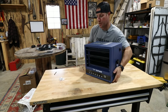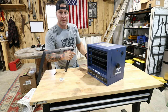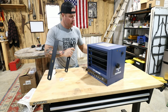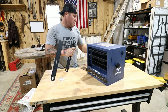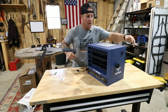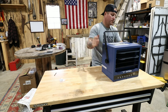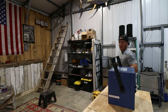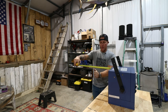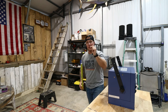The mounting bracket is secured to the wall. Now we're going to take the heater's bracket and get it mounted. It has a three position mounting spot and comes with knobs you can twist to easily tilt it, which I'll probably do — we'll tilt it down so it faces our work area. I'm going to measure my wall distance because the requirement is 10 inches from the backside of the heater to any wall. 14 inches would be safe, so I'll measure that out and punch a hole.